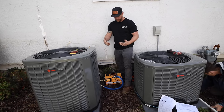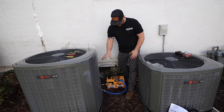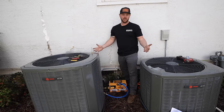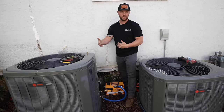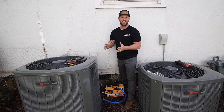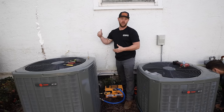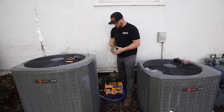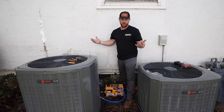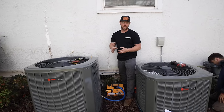Normally what I do when I pull vacuums, depending on how long the line set is, I either add the refrigerant I need to add — breaking the vacuum with it — or I just open the valves. On this particular system the line set is only 20 feet long, so we're not going to have to add much refrigerant once we get it running. I looked in the manual and this unit comes pre-charged for 10 feet of line set. We're not going to be able to actually start this unit up today — I just found out they don't have the breakers installed inside the electrical panel, so we have no power. So I just want to get everything prepped and ready to go, and that way when we come back to start it up, it's pretty much ready to fire up. All I'm going to do is open the valves and our charge is going to be really close — we just need to fine tune it when we come back.